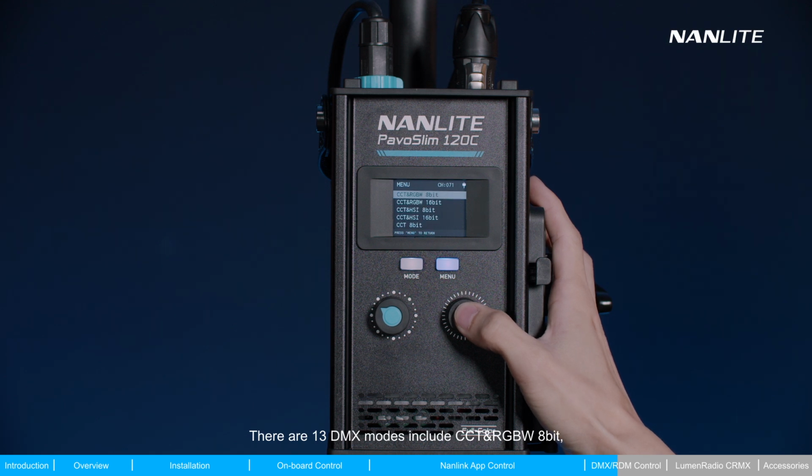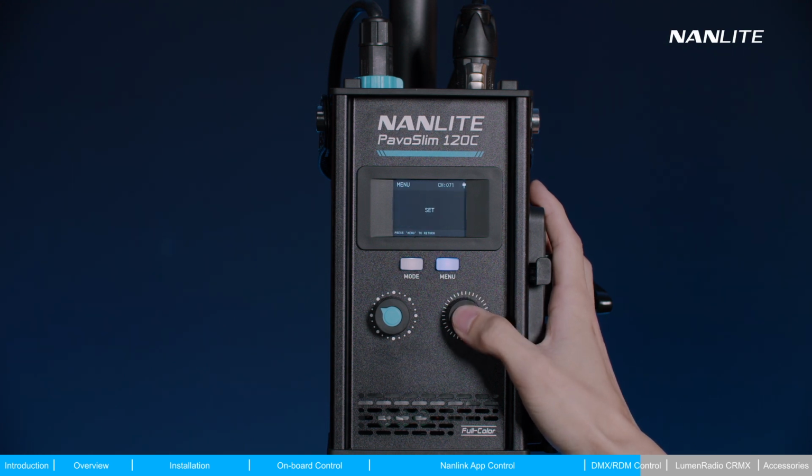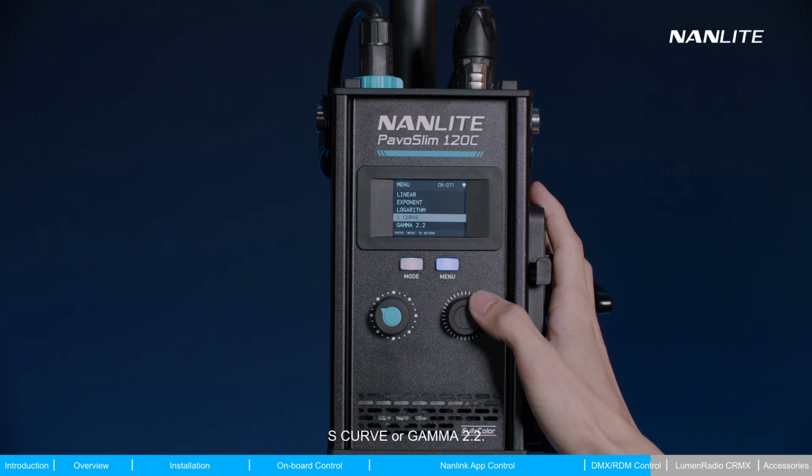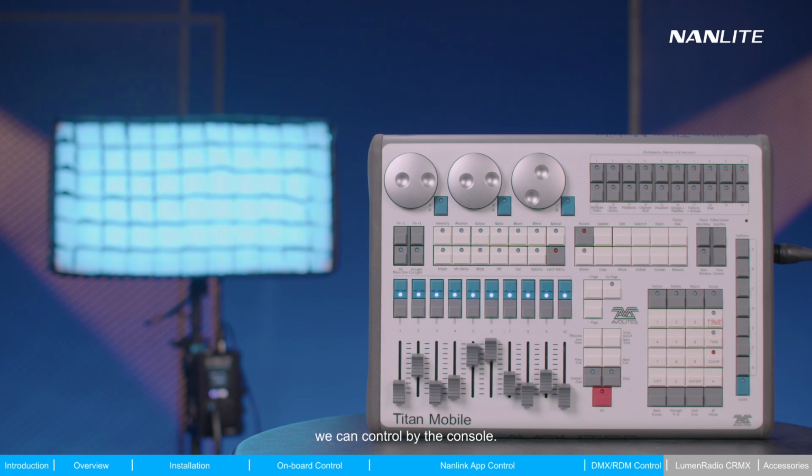There are 13 DMX modes, including CCT and RGBW 8-bit, CCT and RGBW 16-bit, CCT and HSI 8-bit, etc. DMX dimming curve includes linear, exponent, logarithm, S-curve or gamma 2.2. After setting, we can control by the console.